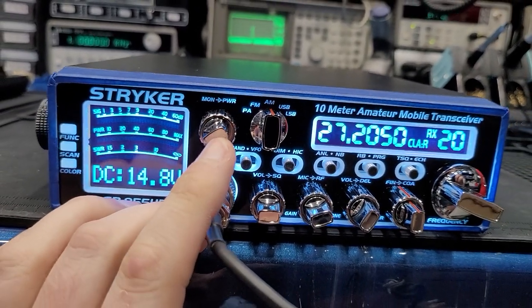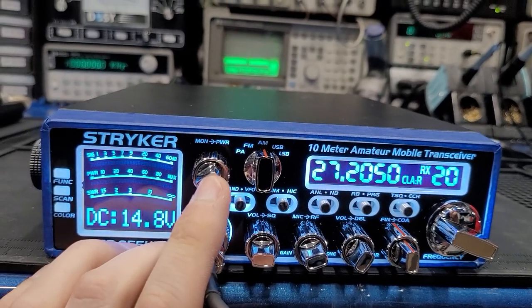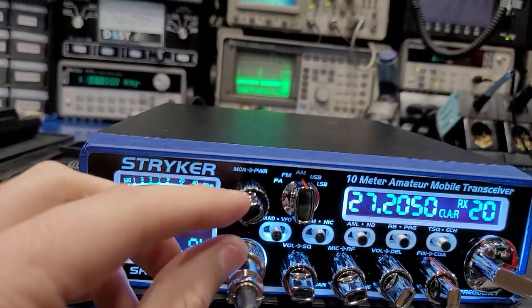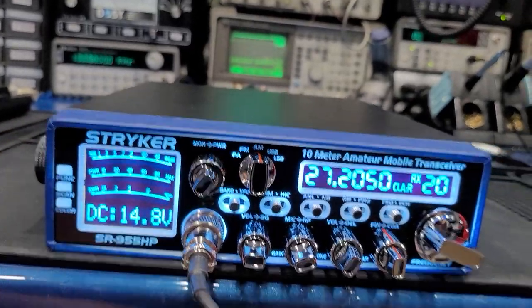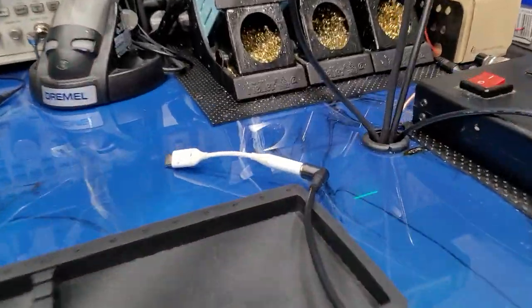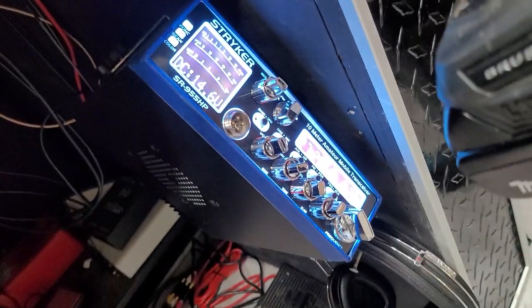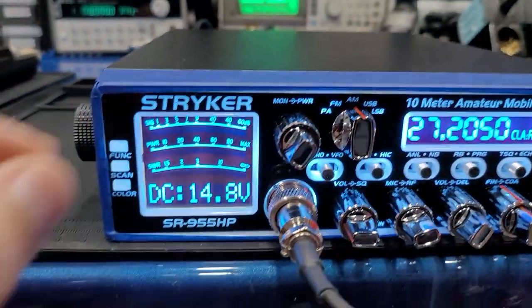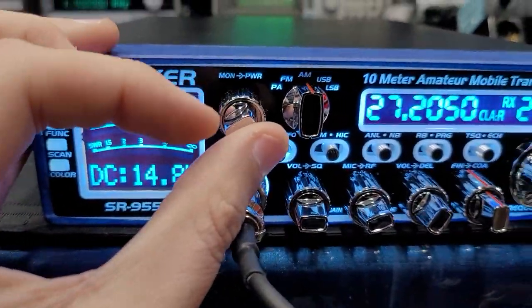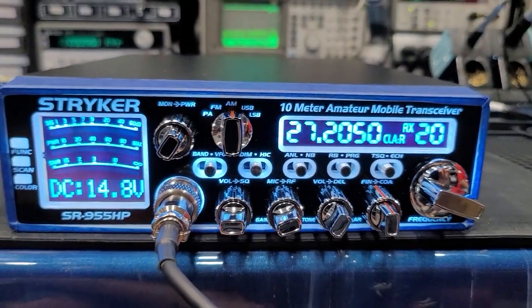And as I told you, this is only talkback. When you pick up your voice on the same MP3 circuit that you're using, that is only talkback. That's not your real sound over the air. Your real sound over the air will be what I demonstrate in the video when I plug into my line level cord that goes into my monitor radio. That's true audio over the air. This little talkback portion that you cut on with the MP3 when you're capturing your voice, that's literally talkback, same way as it was with the Cobra.